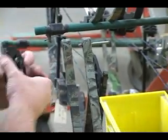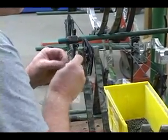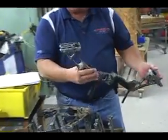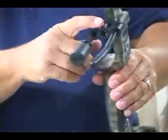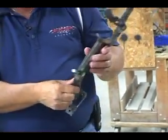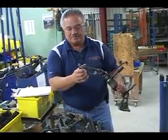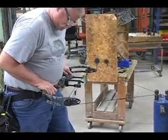And again, I can't stress that every one of these bows is assembled here and worked on by many people, and checked and rechecked, and the quality control. If you look at this limb pocket here that this bow's been assembled on, this is the pre-assembled bow that we talked about just a minute ago. It's got the pivots in it, it's got the limb bolt on it now, it's got the grips on it now, it's got the cable rod in it, suppression systems are mounted and ready to go. Then it comes up here to the final assembly, and that's what he's doing now, is assembling the limbs to fit into this bow, and then he'll string it. We'll put it on a stump and test it, and we'll do a final inspection on it, and it's good for the field.